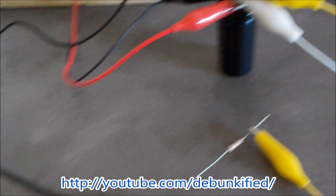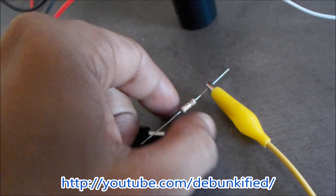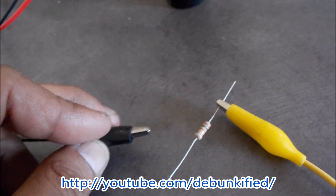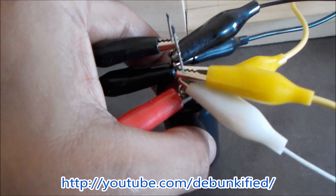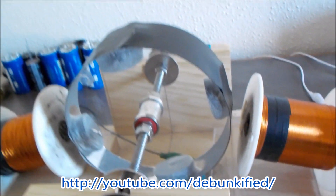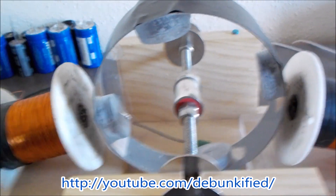This is all about balance. If you just leave the load connected continuously, the output will quickly drop to unity and then below unity — it's a temporary effect. So it's important to do certain kinds of switching to keep the energy up. This is a fairly large capacitor, so it takes a while to store energy. As it charges up, it becomes less and less of a load on the rotor, allowing it to reach full speed and input current to drop to a stable figure.